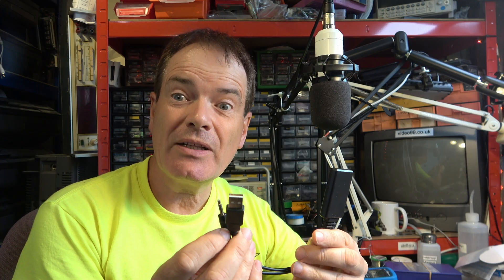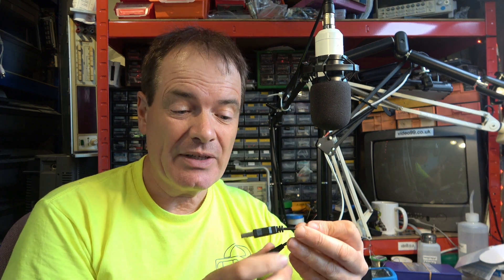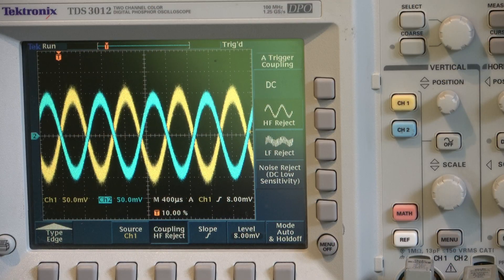We're going to have to investigate what's going on in the Bluetooth receiver. We bought a little gadget for Alex's new car — it goes from USB power to audio out, and inside is a Bluetooth receiver. We thought we could play music from his phone in nice quality stereo, but it didn't work. It's only mono, it seems to have two channels, and it sounded absolutely awful. With your head in the middle it sounded out of phase. A 1kHz signal confirmed the two channels are out of phase, and the audio also sounds and looks noisy. I put up a poll on the YouTube community asking whether to send it back or dismantle and investigate, and you guys voted to dismantle it. So let's do just that.